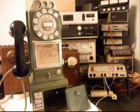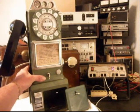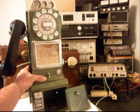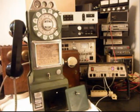Basically we've gone through a little bit of everything on this telephone. Now Ron had his keys to his locks, and that's a plus. And whenever taking off the body, you always want to grab the phone and push in this area because it's spring-loaded. So when you unlock it, you want to clamp it down or push down on it and unlock it. And when you lock it, you want to push down and lock.